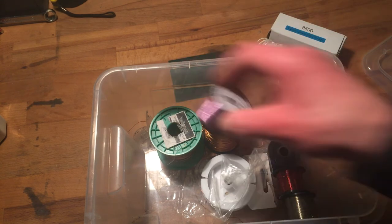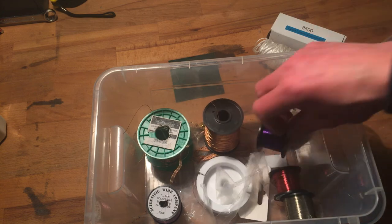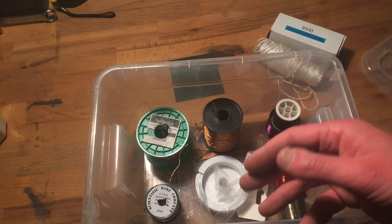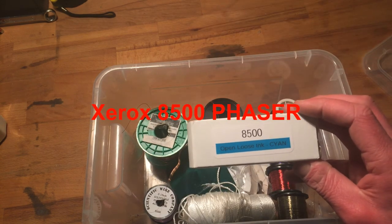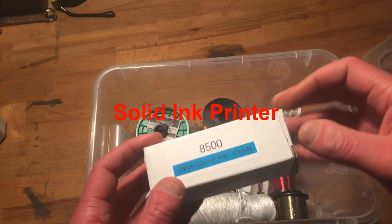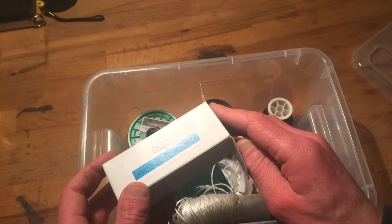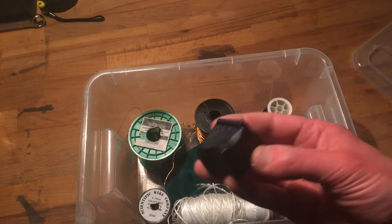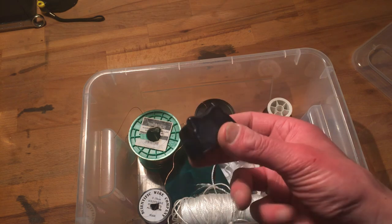These are wires for the planar speaker thingies - some ordinary copper wire, more wire for the planar, and I'm waiting for new wire for the planar. This by the way is ink for the printer I use for etching laminate. Most people don't know this kind of printer - it uses wax ink. You put the wax block in the machine, it melts it, and then you can print with it. This is a Chinese version - probably not recommended by the manufacturer - and this is my etch resist.